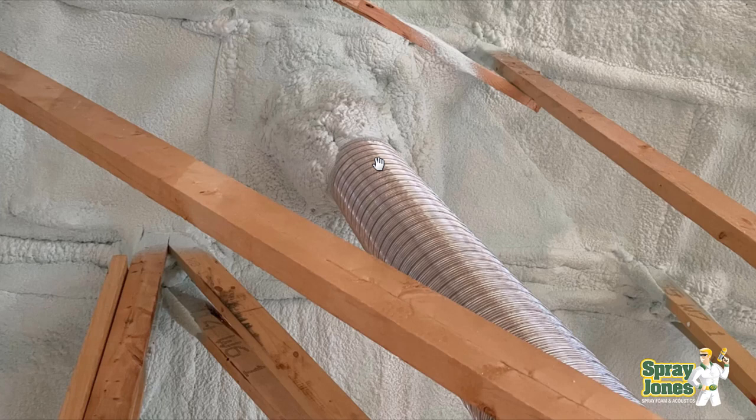The outer jacket is cool enough that it won't reach degradation level on the spray foam. Above 180 degrees Fahrenheit the spray foam will start to break down, char, and disbond. This is the only proper way I find to deal with these — the jacket is not super hot, the spray foam comes in contact with it, it seals the roof deck airtight, you won't have condensation inside the roof deck, the hot gases can get out the middle, and the cold air can come down without condensing on the outside of the liner.